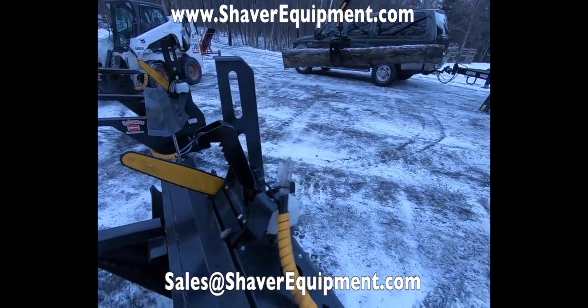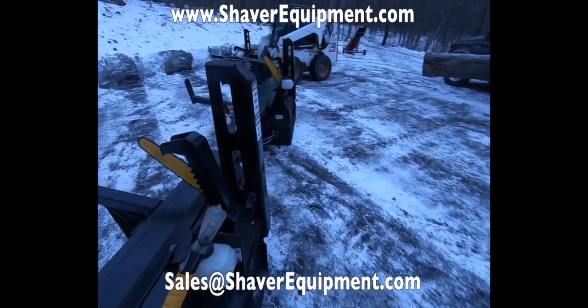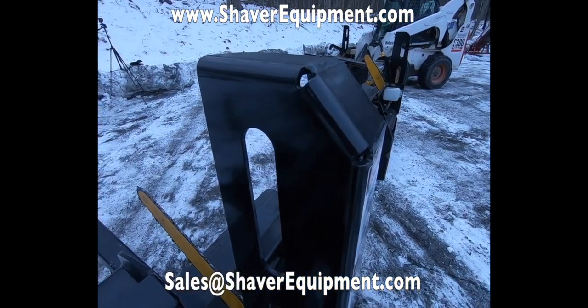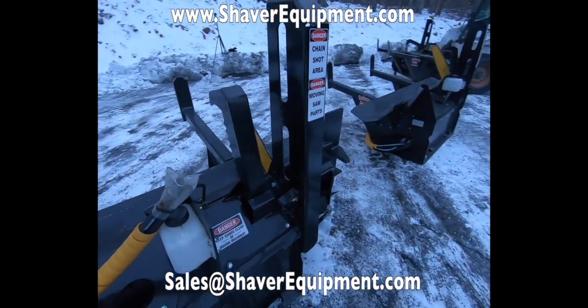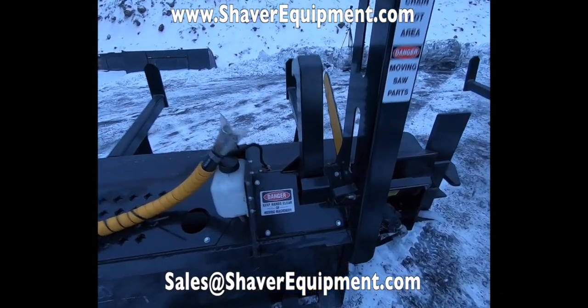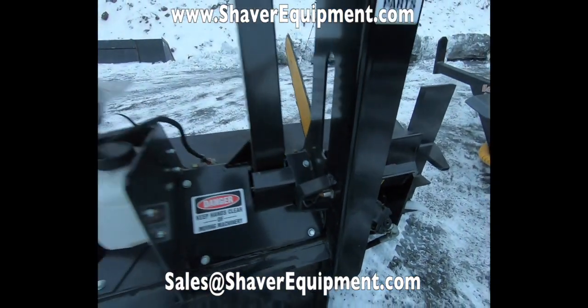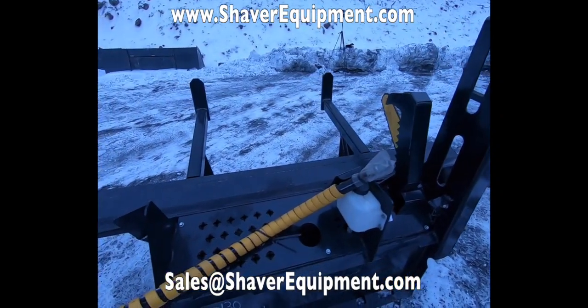The top here on the saw guard is a little bit different. It's got a bent angle that's welded together versus the solid round one like on the 140s. Same proximity sensors. There's a proximity safety sensor that the saw has to be all the way back in the stored position before the table goes forward, and there's one down in the table that it has to be all the way back before the saw bar will engage.